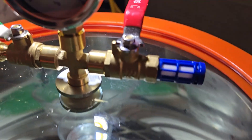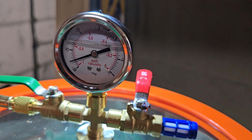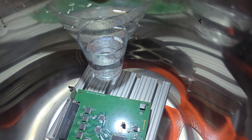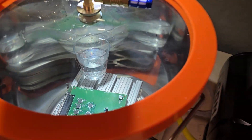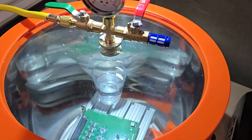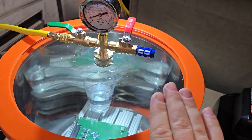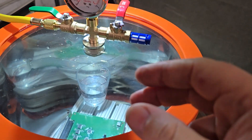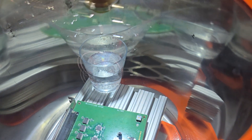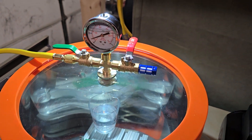I can shut the pump off too. When you shut the pump off, you'll notice it's still drawing quite the vacuum — we're at about 28–29 inches of mercury. And it stopped boiling, but there's quite the vacuum in there. As soon as I start that pump back up, it's going to start boiling again. Why? Because as it evaporates, it's creating gas, and that gas is returning the chamber to just above the pressure needed to maintain liquid. So the water will continue to boil as soon as I turn the pump back on.